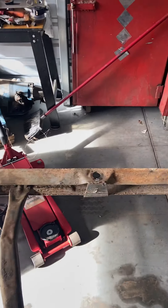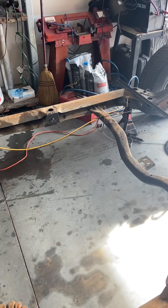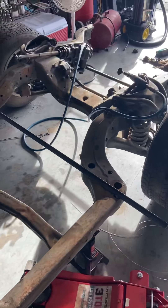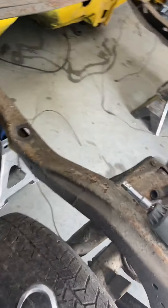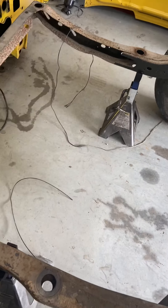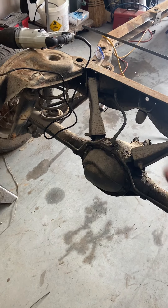It's fairly thin, so if you start really putting the heat to it you will warp that chassis. Welding in those various areas gives each little area a few minutes to cool down before you start on a new area. Once you get about four or five one-inch beads on the top and bottom, you can go ahead and burn it in because at that point it'll be pretty stiff and rigid. I'm going to sandblast this entire chassis and take this whole front end apart because all that's going away anyway — same with the back, including factory exhaust hangers.